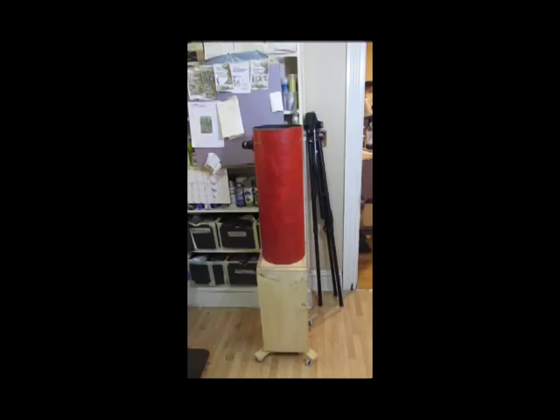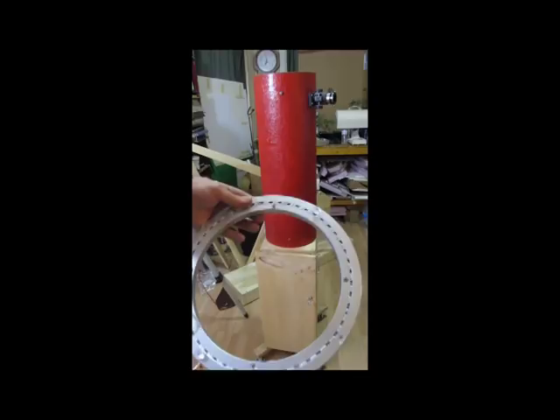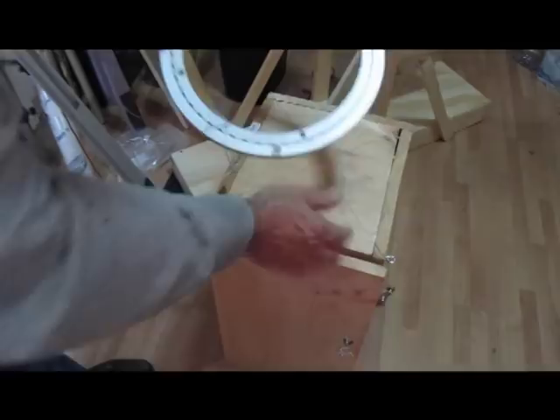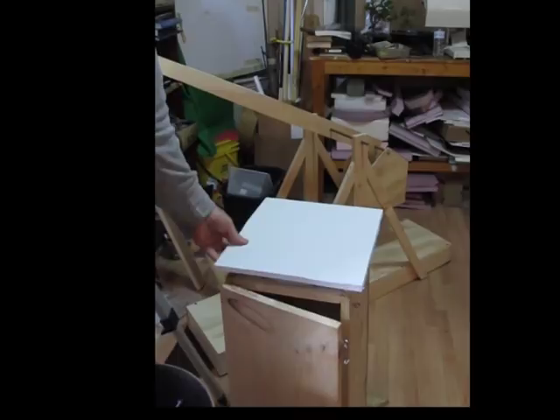Now we get to the fun stuff — you're wondering about that Lazy Susan. We need some kind of a yoke — a fork yoke. I made some foam board ones first to get the right size. Here's the Lazy Susan — I think it cost me $11. These are wonderful; they have ball bearings in them. You screw the inner ring down to your base cabinet, and then the outer ring screws up to the yoke. And then this will rotate like this — really very simple.